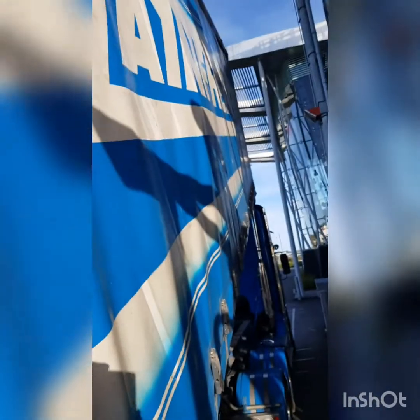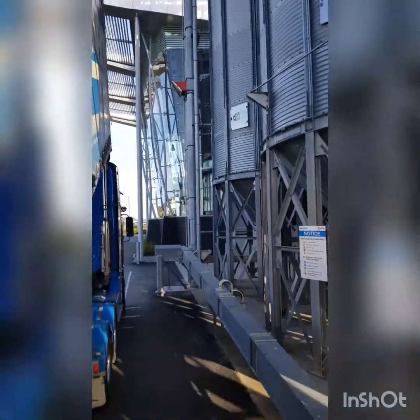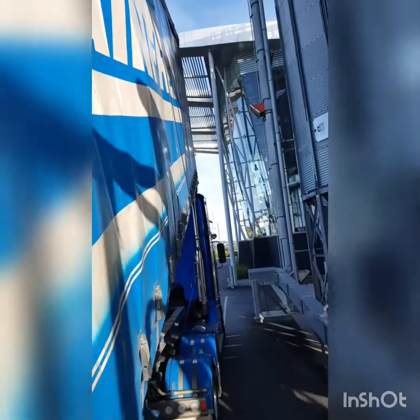So we put these boards in, and then we put these pellets in here, and these pellets basically give us a guide for when the grain's running down the unit straight into the chute. Otherwise you'll get a bulge basically happening in here, and it rips the front end of the unit up where the bag's attached to the floor. If you imagine that bag trying to shift to the back with all the weight, it actually will rip the tags right off. So with these pellets here, it helps guide the grain towards the back here.